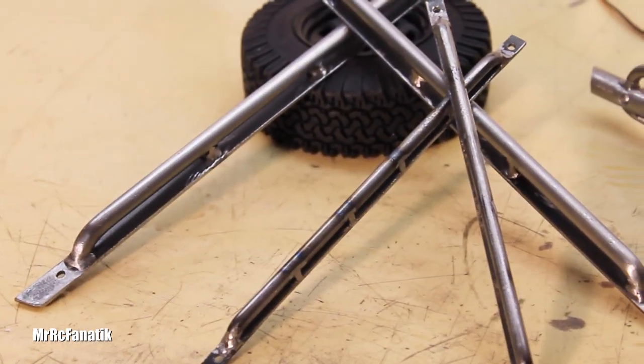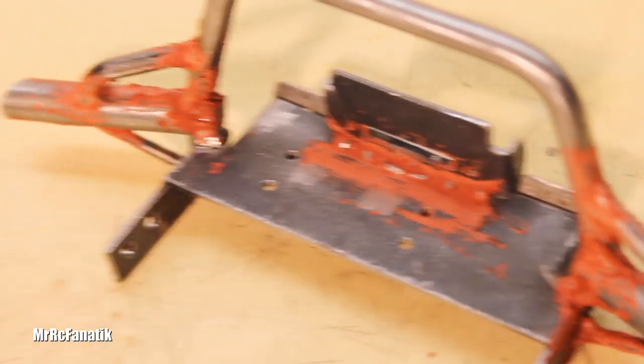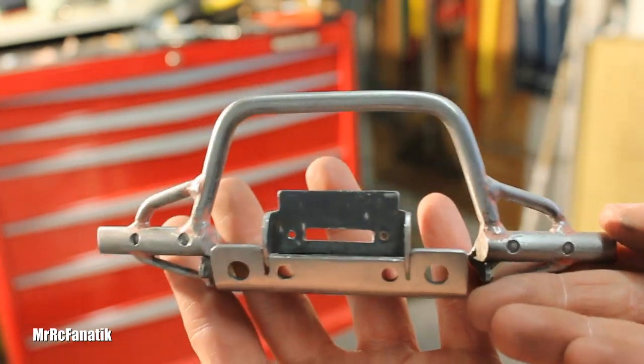This is all steel, it's all being welded — not brazed. So with the welds, you grind them down afterwards best you can. They're usually a little pitted. So you stick in a little bit of glazing and spot putty, sand it down smooth, and paint over that and you end up with a really nice product.